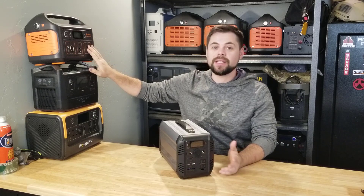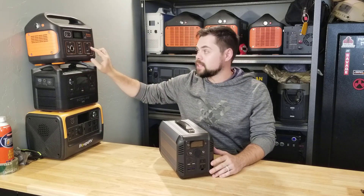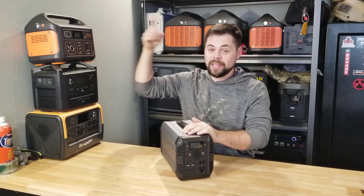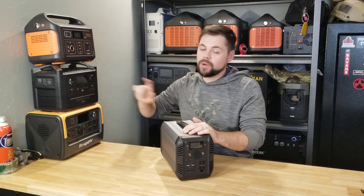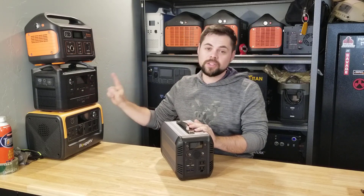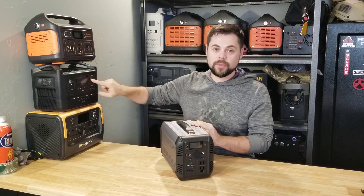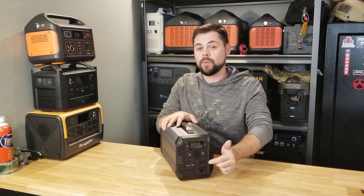The Jackery 500 is a decent unit I've reviewed in the past, but it doesn't do everything it says it will — that's my issue with Jackery. The Jackery has one AC outlet whereas the CN505 has two, and the CN505 has a 60 watt USB-C output which the Jackery does not. These are about $470 usually, though there's a deal bringing it to about $425. The EcoFlow River Max with expanded battery is also $470. It has a slightly smaller battery but a slightly larger inverter, and crucially has twice the solar input — 200 watts versus 100 watts on the CN505. It also has three equally-spaced AC outlets vs. the CN505's one three-prong and one two-prong.